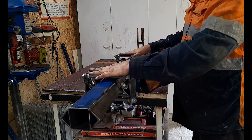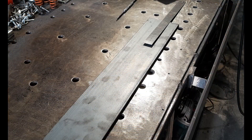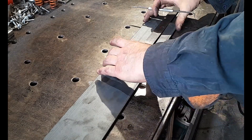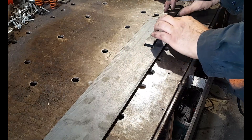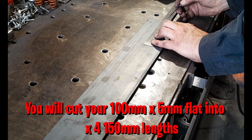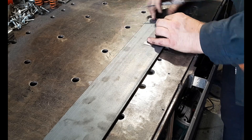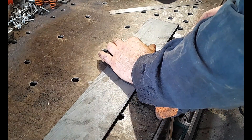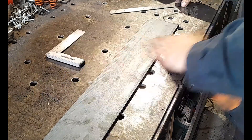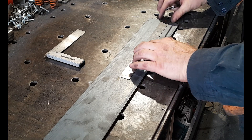Let's get onto our plating to join our top frame to our mid frame via our trolley rails. Let's get our plate carriers made for our front motor mount and our uni-joint. You'll need to take your 100 by 5 millimeter flat bar you've got remaining, measure 150 millimeters, mark that, put your square on, and draw that line in. You'll do this three times — three 150 millimeter pieces.